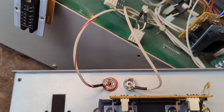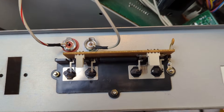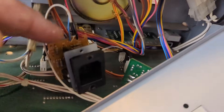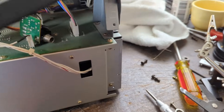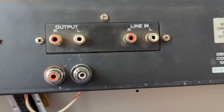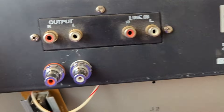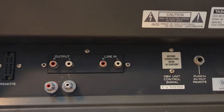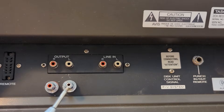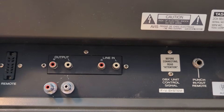We got those two wires soldered up to the RCA jacks and bolted back onto the back plate. All we have to do now is attach this back on, and this other little piece here. When we're done it's going to look like that — we have a couple of tape head out jacks on the back of our Tascam 32. Now we can use this external tape head preamp to get the IEC equalization we need to play the pre-recorded tapes. Those right there are our tape head outputs, coming off the second tape head — the third head from the left.